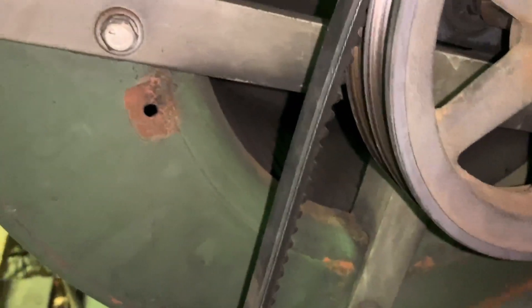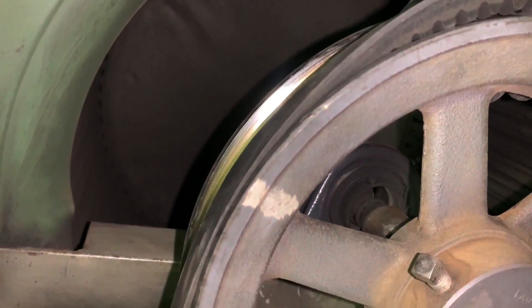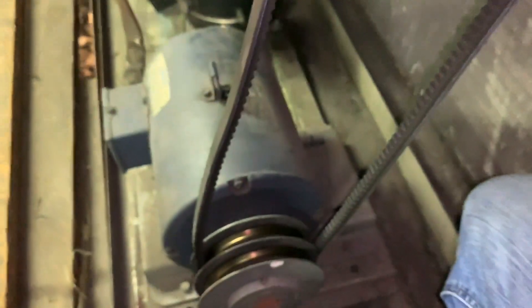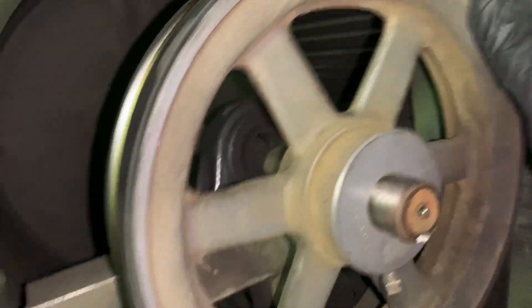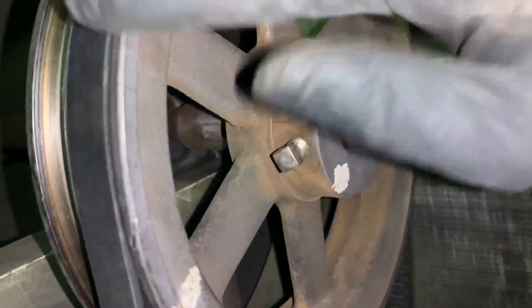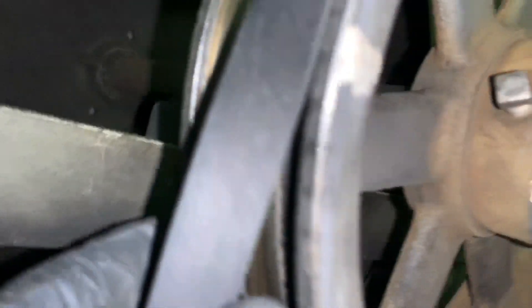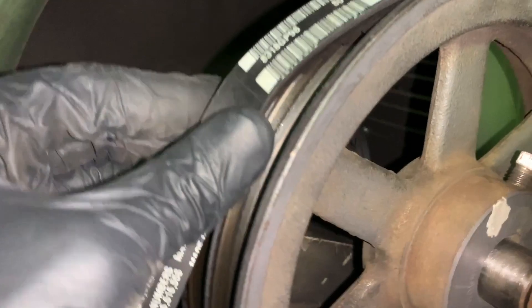Go to the front section — the outside. So you're on the inside over there but on the outside up here. See my hand, see the belt — the whole setup is inside. Then simply rotate, rotate. Now you see the belt is on but it's mismatched. To get the belt over to the correct groove, just use your finger or a screwdriver and push while you rotate.